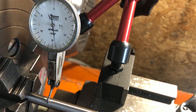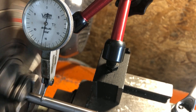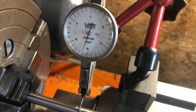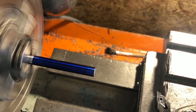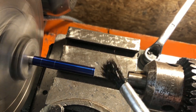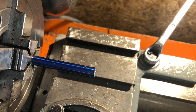The stock supply for this is ground and polished silver steel, with the factory diameter forming one of the finished surfaces. With this in mind, I'm dialling the stock into the four-jaw, ensuring that the section that is to remain untouched is as close to the jaws as possible. After marking off the dimensions for the stem, I will need to support this with a centre. As this is going to be reduced to one eighth of an inch, I'm drilling with my smallest centre drill, and then supporting the part using a half centre to give me access for the tool.